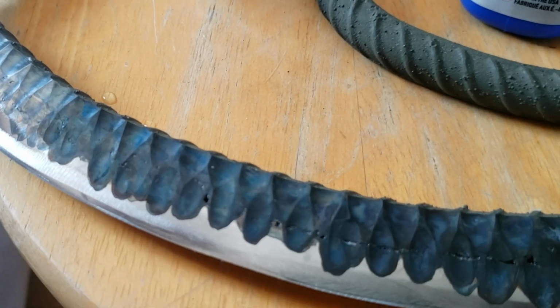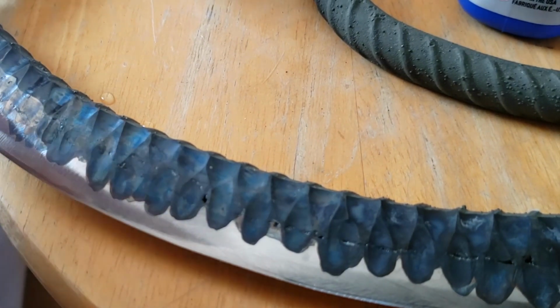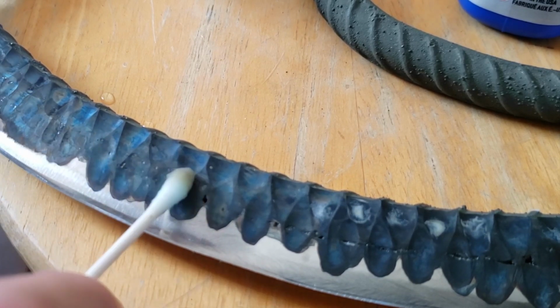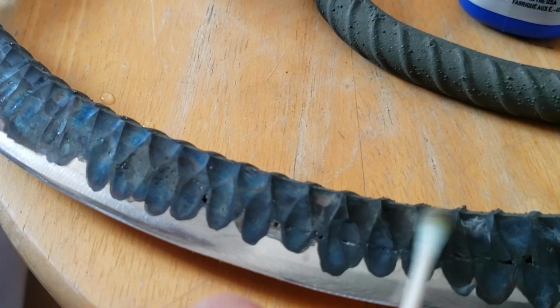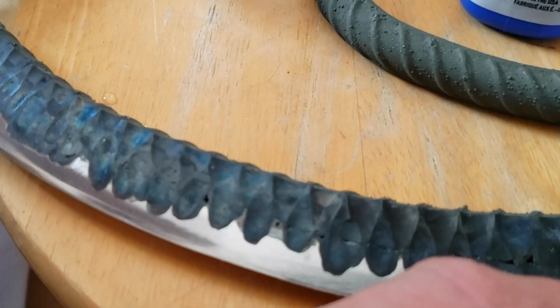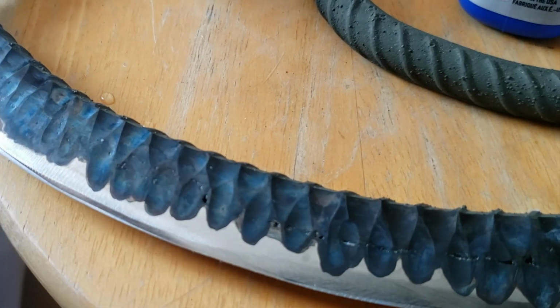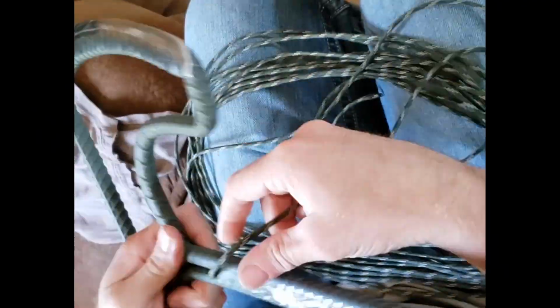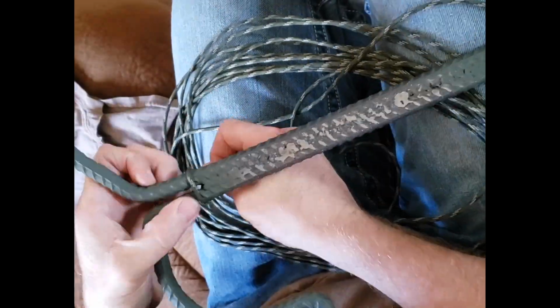And you can see how it's overlapping on the blade, but when you go back and grind the blade with that, you know, 1,000 all the way up to 4,000 grit, it cleans that up. You don't even have to worry about it. I mean, obviously, the less you can get on where you don't want it, the better. But again, the sandpaper does the job.